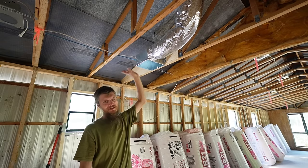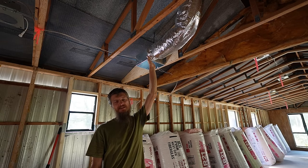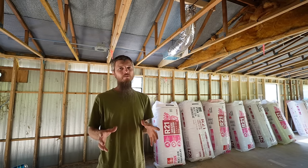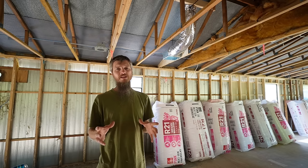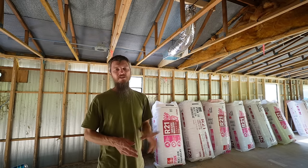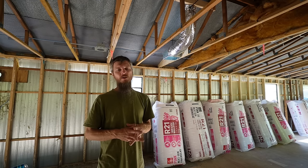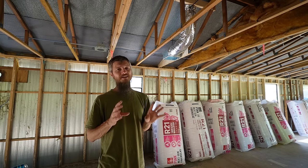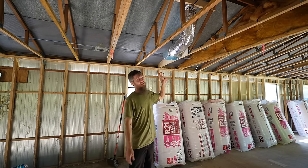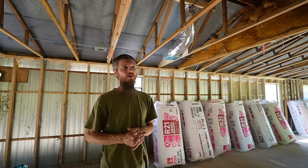One thing I have to do first is test out this ceiling fan. We put this ventilation fan in for our bathroom, and something about it has bothered me ever since I installed it. I wanted to keep the roof vent simple and to a minimum, so I put a three-inch vent pipe out the roof. But this fan is designed for a four-inch duct, and you really shouldn't size down on ventilation fans — going from a four-inch to a three-inch is not a good idea. I was just doing it because I felt I could get away with it. It's not proper, but it's a very short run, very direct, very little resistance, so I said maybe I can get away with it.